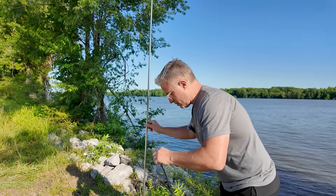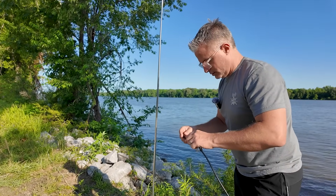Investing in one of these is a slam dunk for us. I got this many years ago and wondered whether I would use it, and we use it all the time for spot-checking — it's small enough to fit in our portable backpack. When actually building the antenna, we basically cut it a little bit longer than we need, and then very carefully fold it back or trim it back. When you fold it back, it makes less of a difference for the same amount as trimming, so it's not a hundred percent one-to-one. One of the biggest tips: measure the SWR twice using your antenna analyzer and cut once. We found that out the hard way — we cut too much and ended up outside of the CW band range.